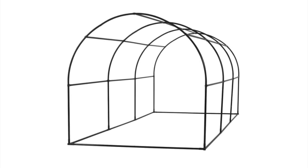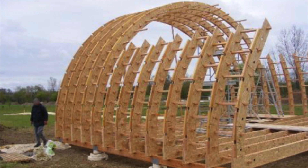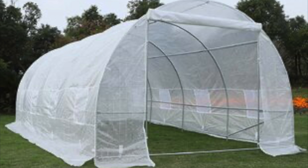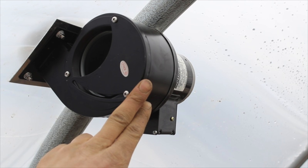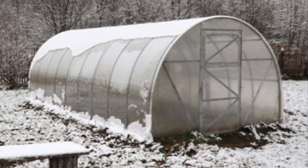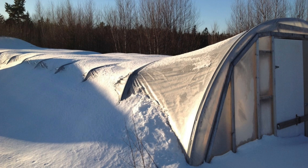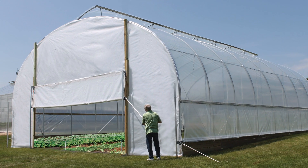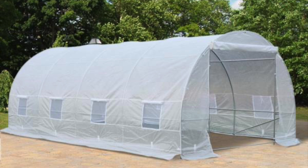The most simple and most common greenhouse design is the Quonset, high tunnel, or also referred to as the round arch greenhouse. You can fill the arches with any of a number of materials — wood, steel, PVC, just to name a few. The basic design is to bend the material and stretch a plastic over the top allowing light to come in everywhere. You can go single layer or double, using an air inflation fan as the most common double layer device for high tunnels. Of course you can build a simple high tunnel or a fancy four-season Quonset. Many have roll-up sides to aid in ventilation. The downfall is some arches aren't very strong and snow loads can crush the frame, and the round arches make using glass or hard panel polycarbonate difficult and expensive. But if you're okay with just covering your greenhouse with plastic sheets, this type of structure is common, cheap and very functional for growing.